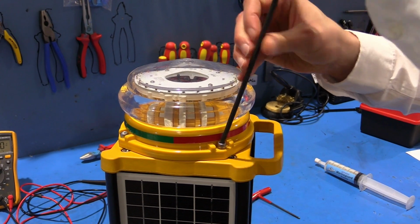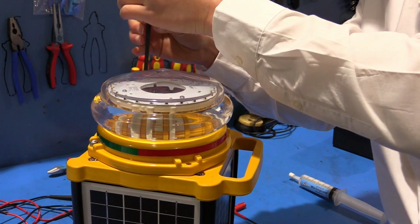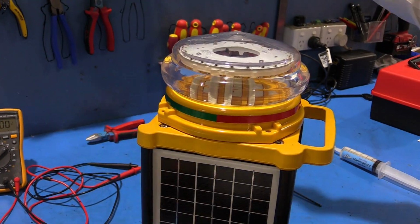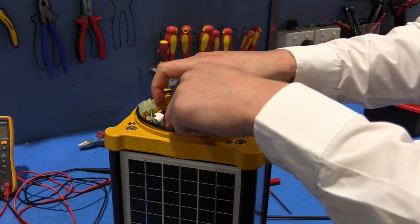The AV-426 has an internal battery compartment which provides the user with the ability to change the battery after years of operation. To begin the replacement process, remove the 4 M5 socket head screws using an M5 Allen key at the top lens assembly and separate the AV-426 lens assembly from the body.